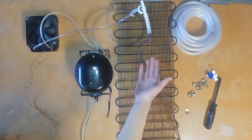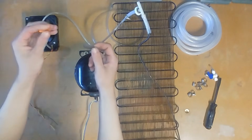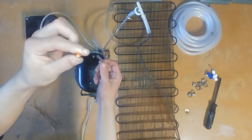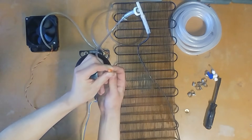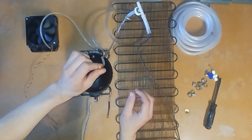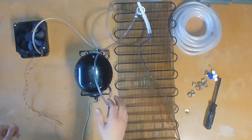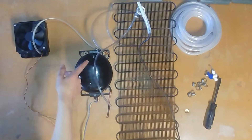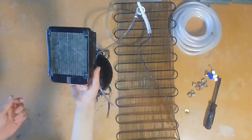It comes out as cooled liquid, then goes down through the tube and hits a small needle-like hole that I punched in the syringe lid. That restricts the flow, spraying only a small amount of liquid into the radiator at a time so the compressor can keep up. The compressor is also pulling a vacuum on the radiator, which makes the cooling effect even greater.